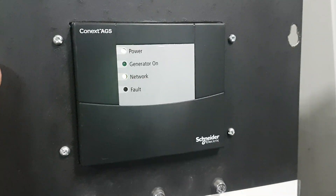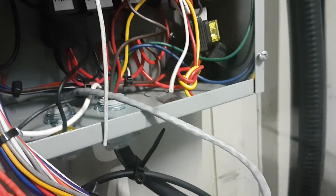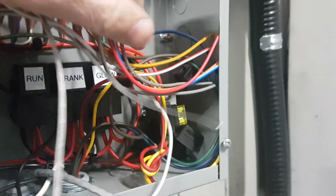So there you go. We take and put relays in there so that the actual AGS does not do the switching. The AGS is running the control circuit, which runs the coils. This end drives the power through. So we put fuses in it also. I opened a couple of fuses so you can see them there.